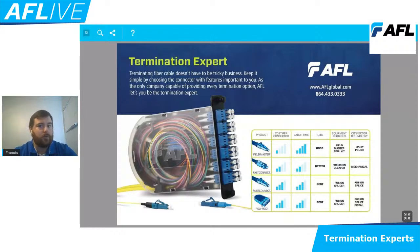So we actually have two different options that we can pick here. One is going to be a Fuse-On connector. Like I said, probably the world's smallest pigtail. We would actually take that in a package, put it directly into our fusion splicer, and then take our incoming cable. We would prep one side of that cable and also add that into our fusion splicer. And then the fusion splicer would put those two pieces of glass together, and we would build the connector around that Fuse-On point. So a couple of benefits there. It allows us to only prep one incoming side of cable.